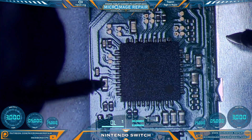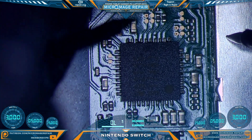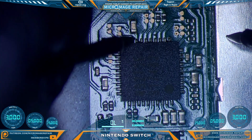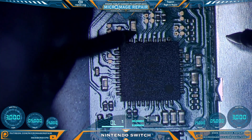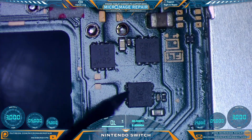This capacitor right here has two lines going to the chip - in that case, one side will always be ground. As long as only one side is ground, we're okay. For our CPU capacitor, we do not want the line going to the chip to be shorted to ground, and we better be okay there.